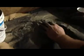You basically create a little well, bring the water in, and the consistency mix that you want to get is somewhere between a sandcastle sort of mix and something that's a bit drier than that. Whilst it is a wet sand, or as it says, green sand, it's not wet to the touch. When you're talking about this sort of mud consistency, that's way too wet. You don't want to be going for that sort of consistency at all.